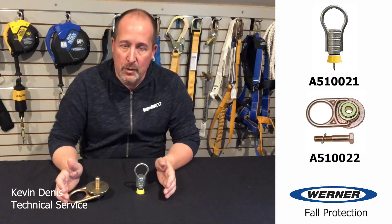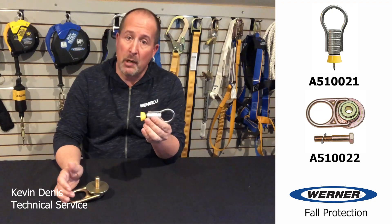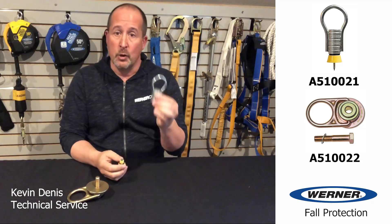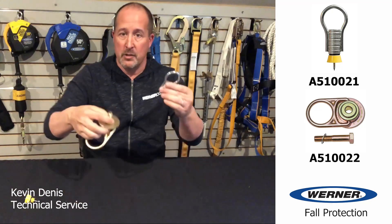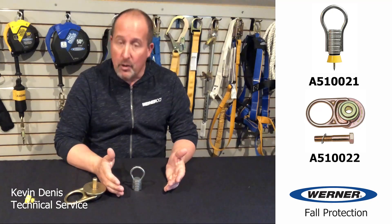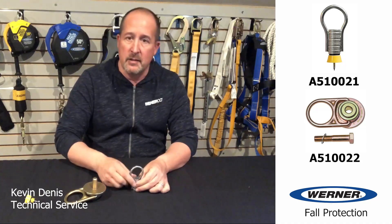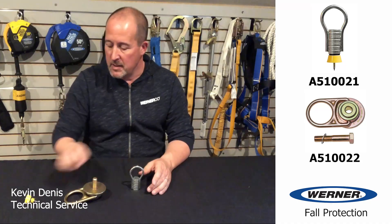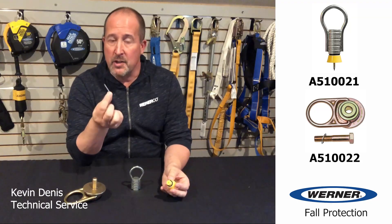So let's take a look at the parts and how it goes together. This is the straight loop insert. It has two parts: the embedded loop and the yellow installation plug. The loop remains in the concrete, and once the yellow installation plug is removed, the mega swivel bolts into the loop. The loop is surrounded and filled with concrete, giving the system its strength. It doesn't have to be connected to rebar — it gets its strength by being poured in and embedded into the concrete.